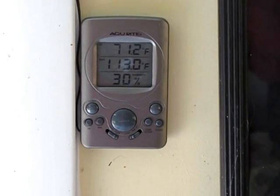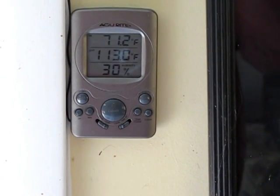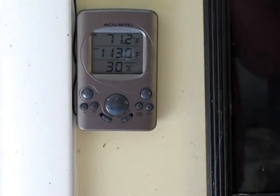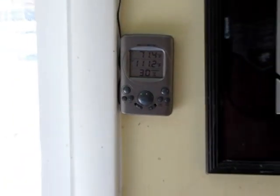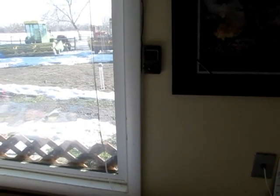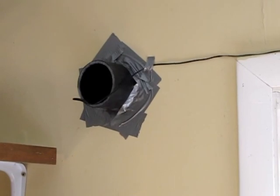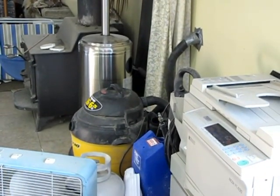I played with this thing for about an hour. The temperature ended up going up — it got as much as 122°F, which was kind of impressive — and the overall temperature of the building went up to 71.2°F, so all in all it's been successful. That blower was awfully loud. I'm using a six-and-a-quarter horsepower shop vac that puts out 190 cubic feet per minute. I did take a control measurement and it adds 7 degrees Fahrenheit to the air on its own, but even accounting for that, it still maintained 40-some degrees of gain. I've got to get some kind of a vent that looks better, and I'll probably find another blower source — don't really want to burn that shop vac up.